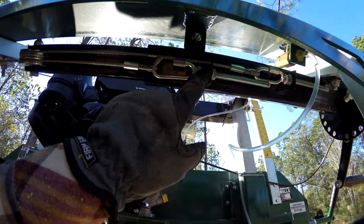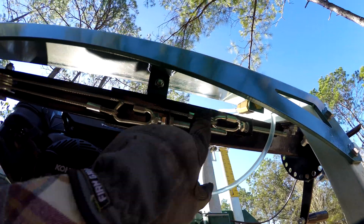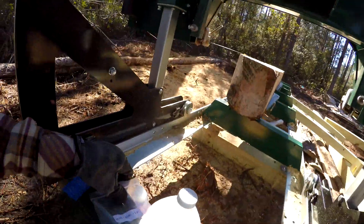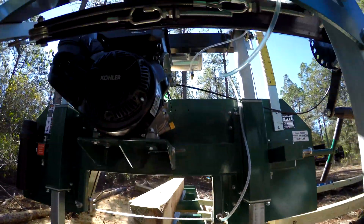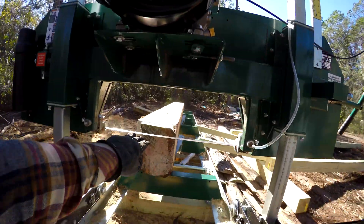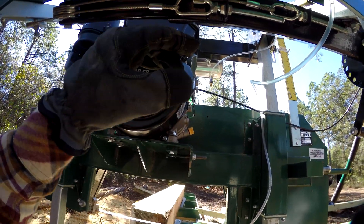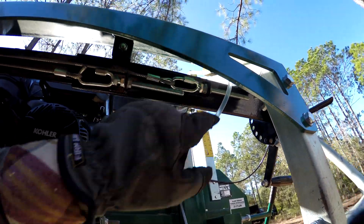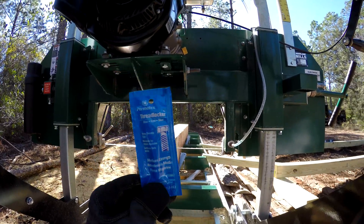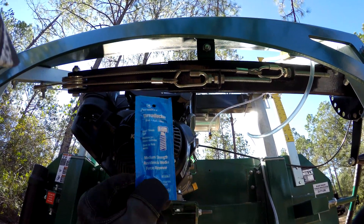Here's a project on the sawmill: this nut had come loose — I think through vibration. This one's still fine, but this one is not, and it stretched out this little C-clamp piece here. Woodland Mills sent me another one, and I'll say their support is incredible. I'm going to lower the head all the way down, loosen this nut, take it all out, put the new piece in, and re-level it. Woodland Mills also sent me some blue Permatex thread locker — you want blue, not red — so I'll do both of these right now.